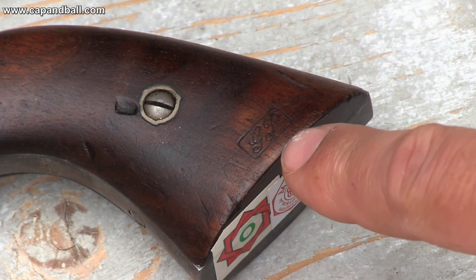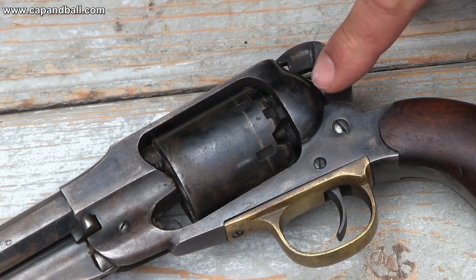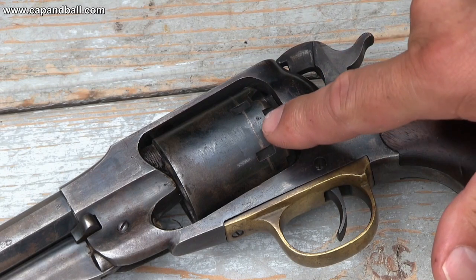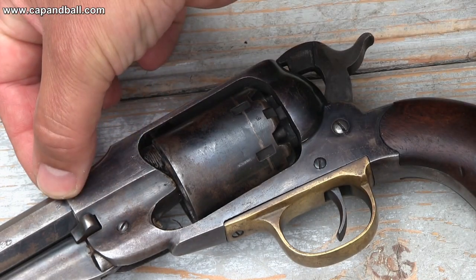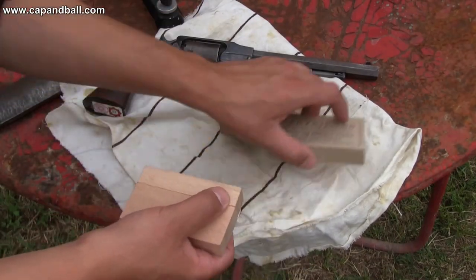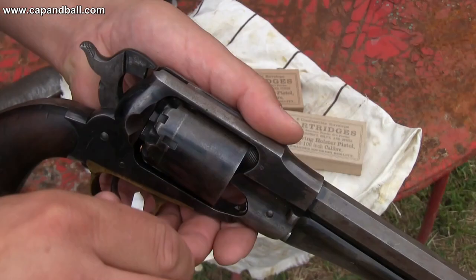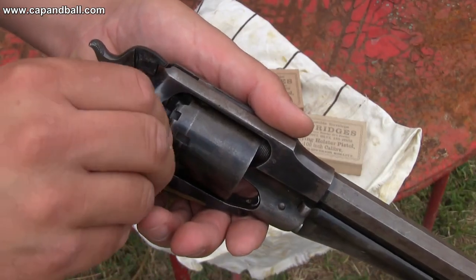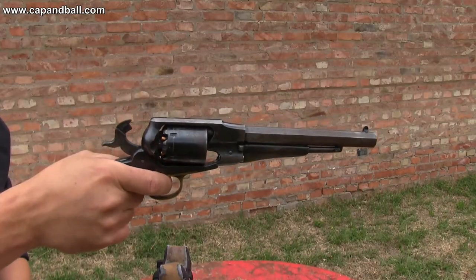The GP cartouche on the grip stands for Giles Porter, Main Inspector. All the parts of the revolver are marked with sub-inspection marks, indicating that all parts passed the inspection individually as well. The main advantage of the Remington was the solid frame. The system was stronger than the open-top Colts, and the sights are placed on non-moving parts, increasing the accuracy of the pistol. If you start shooting a clean revolver, begin with snapping caps on each nipple to clean the vent holes from oil.